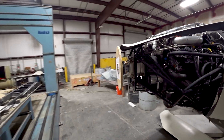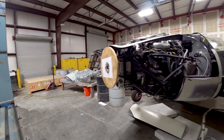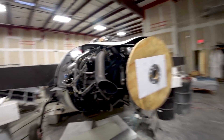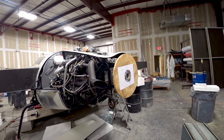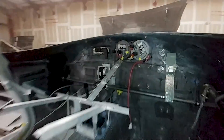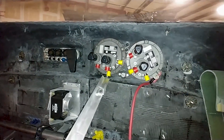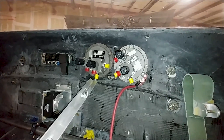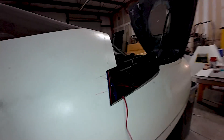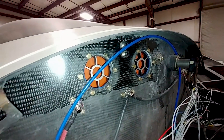I told you before about this wheel thing that Jeff made - basically just got that bolted to the prop flange with a bit of an offset, and that represents where the outside of the cowling needs to live, so now he can work up to that with getting the cowling fitted. Devin and I also got the second pressure outflow valve installed into place, put in there with some RTV and then six AN3 bolts to hold it in, so next week we can actually start hooking up the connections for that.